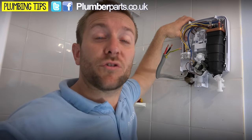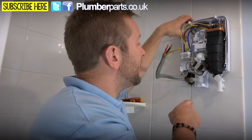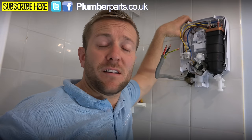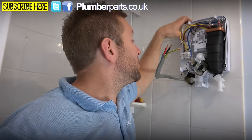There are two old screw holes there. I'm going to have to make that good with a little bit of white silicone. So now I know exactly where I need to put my screws. I've got a hole here at the back and a hole here at the back there. For whatever shower you're fitting, the holes are going to be in different places, but we are just showing you the sort of average method of doing this sort of job.